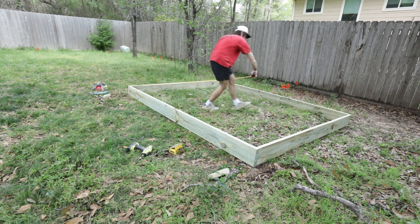We got all the Tough Blocks in now. Let's take a look — here's your corner post here, and then continuing around. Next up, we have our joist hangers, which are used to stabilize the foundation and make it strong. Make sure you do these if you're doing a foundation like this. I'm going to put one on each joist. These are one-and-a-half-inch framing nails — they hit directly into the wood, and there are pre-drilled holes. I don't have my builder here, so I'm going to use my nail gun.